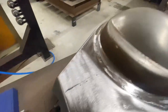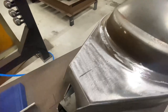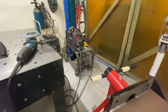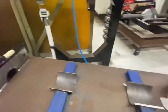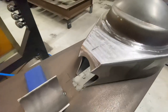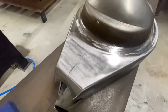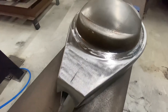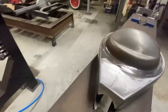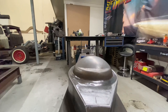So this is the low spot - I'm just going to tack it up. I'll put a straight edge across it just to see if it was low, and it definitely was. So I've got the welder set pretty low, only about 107 amps, and just rolling with my foot pedal - the Nova wireless thing. Welding supply sells them, they're pretty good. I'm just going to pump a bit of filler in it - it doesn't have to be pretty, but this is always a good opportunity for anyone just starting off to practice stacking dimes.